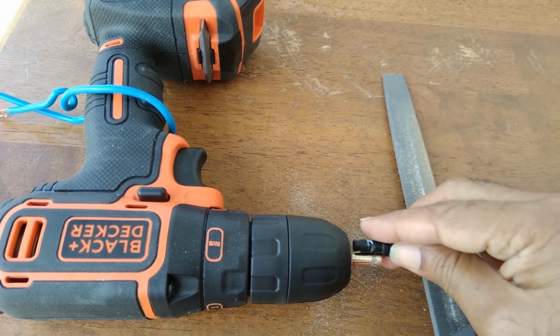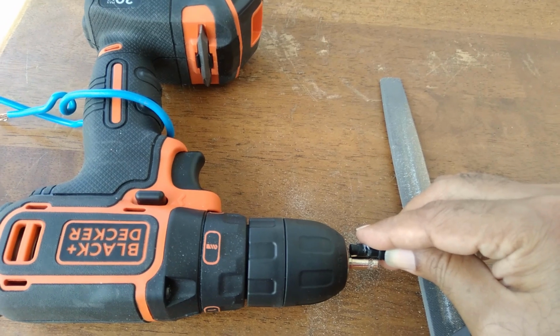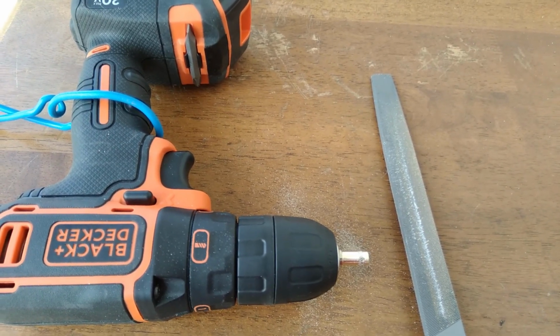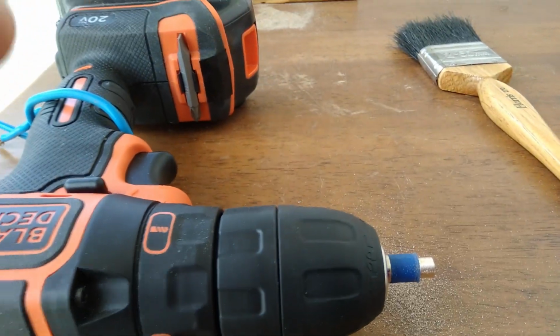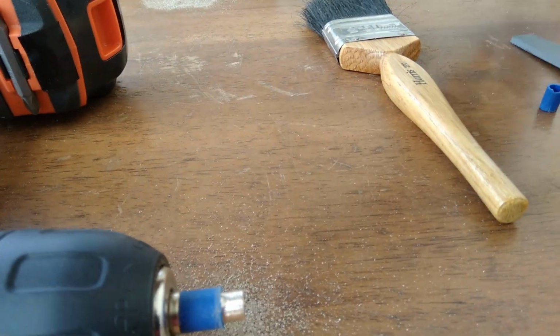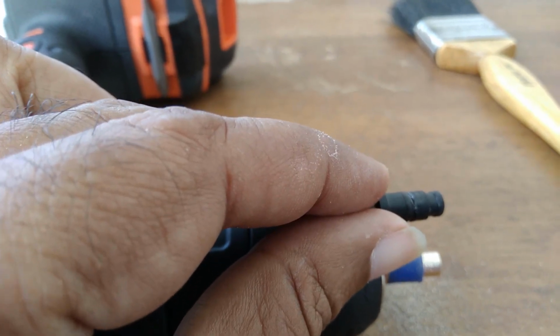As you can see, we are close, but we are a little bit off on that. Probably not quite a millimeter. I'll have to cut that down a little bit and try to get that all sorted. We're coming along slowly. I ended up using a little rubber sleeve, just cut from a pen, and just use that to give us the notch down in the beginning of this. This at the beginning is thinner than where the bearing sits. This is a little longer, but it shouldn't matter.